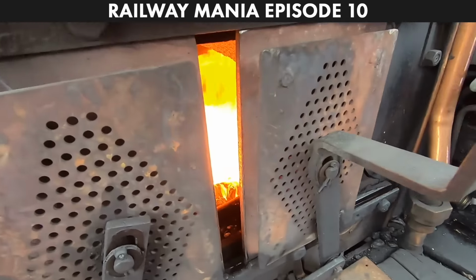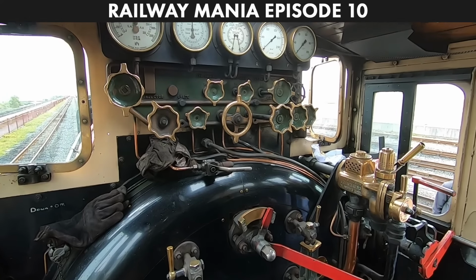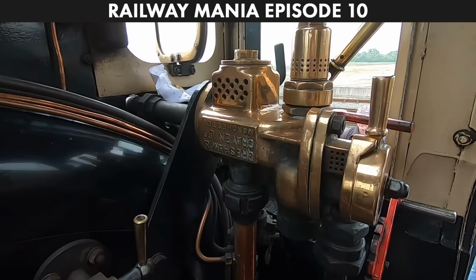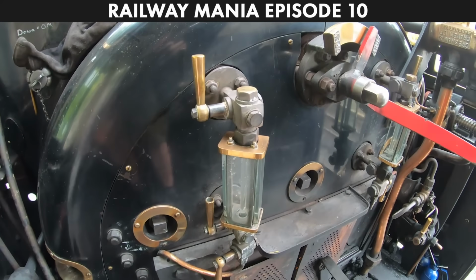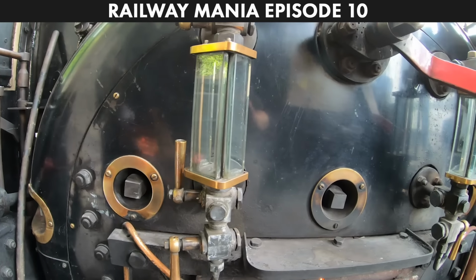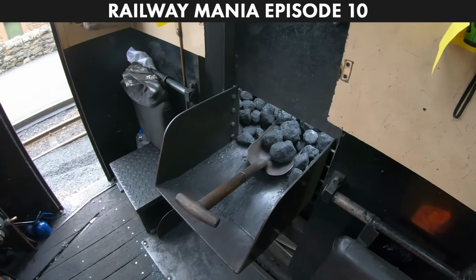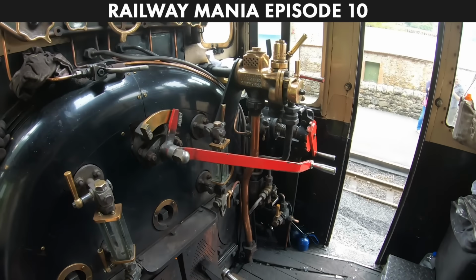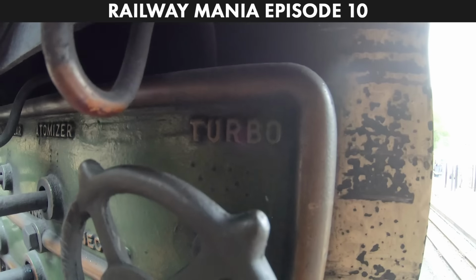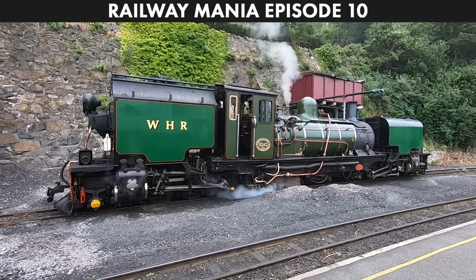So with Garratt number 130, then what is left to do on it before it can enter traffic? Like most cases of locos, there's quite a lot of stuff that's been done in reserve, so quite a lot of the work's been done, but it just needs final fitting. So there's the lubrication system on the rear unit, that's all been completed. We need to complete the main steam pipe on the rear unit, and again assemble all the ball joint arrangement and all the telescopic bit of that. Then the front unit needs the lubrication system fitting to it. Some of it's been made, but it just needs refitting because it was painted. And then finishing off, again, live and exhaust steam on the front unit. The tanks are currently down in Boston Lodge, having some fabrication work done to them. We're having the flanges underneath to carry the water to the injectors all fitted.